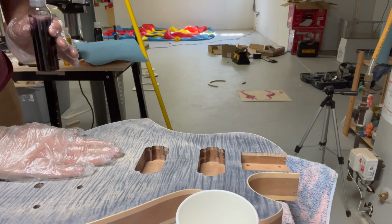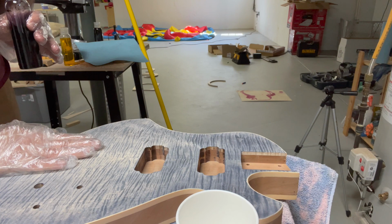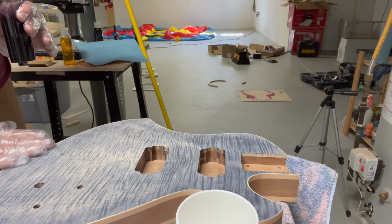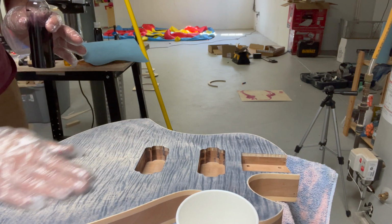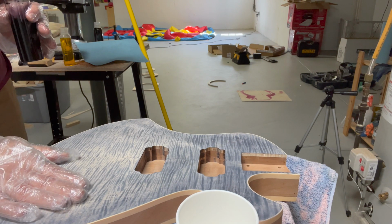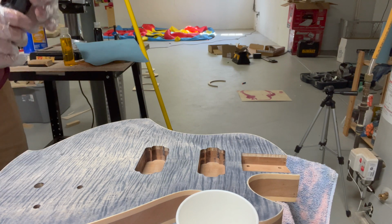I've also sanded to 800 grit at this point, so I'm not sure it's going to take too much more stain. But if I can get a lighter shade of black, grayish, bluish here, I think it'll take out some of the brown and get me a much more streamlined color. I'm getting pretty close to where I need to leave it alone before I mess things up. But I'm going to take one more shot with this.